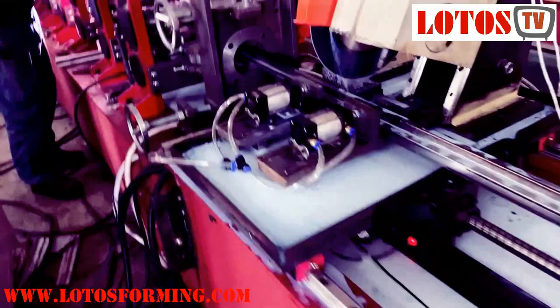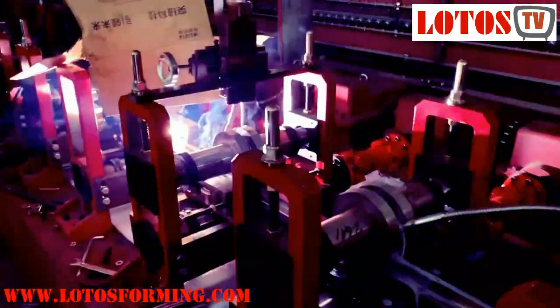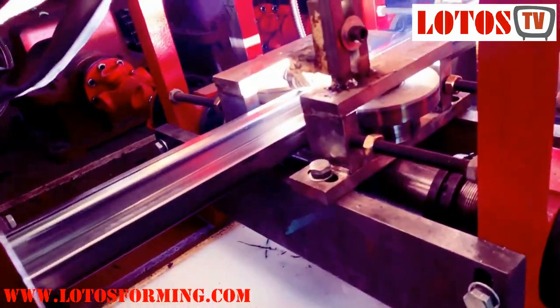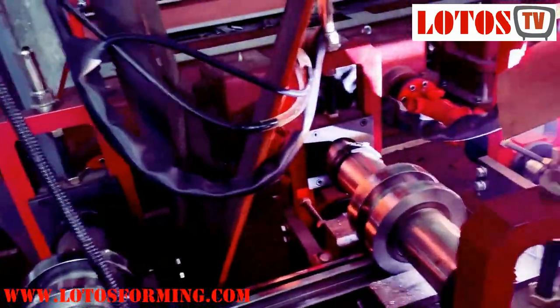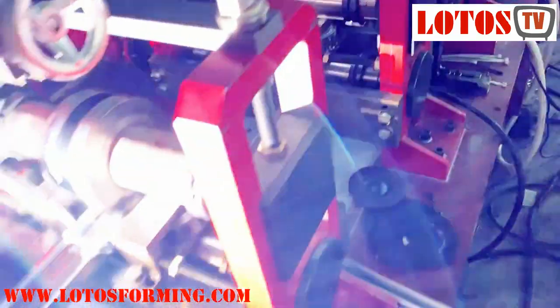GTAW sometimes is called a collapse melting method, which implies that the weld puddle collapses back on itself as it solidifies. Because of this, the effect of gravity is a concern for two reasons. First, the weld seam must be in the 12 o'clock position. Second, if the puddle becomes too hot, it will drop and the weld joint will be defective.